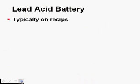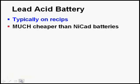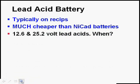You're going to find lead acid batteries on aircraft that have piston engines. And of course, these days you might find a diesel or two, but those are still piston engines. So piston-powered airplanes, helicopters, gliders, blimps are going to have lead-acid batteries. They're a lot cheaper than nickel-cadmium batteries, which we're going to get to. Interestingly enough, you go to Kmart, buy a battery for your car, it's $30 or $40. If you buy a battery for a 172, it's $300 or $400. If you bought a NiCad battery for your airplane for a 172, it would be $3,000 or $4,000. So it's not really worth it. We'll get into why NiCad batteries are worth so much more money.